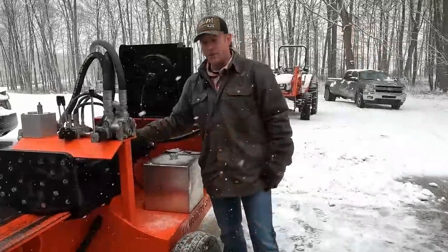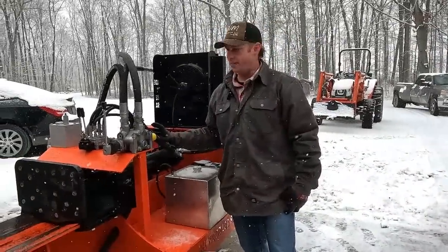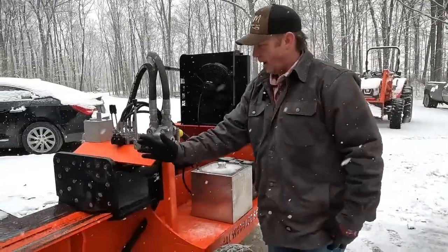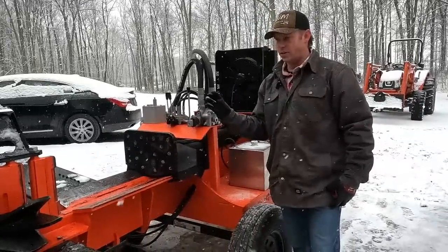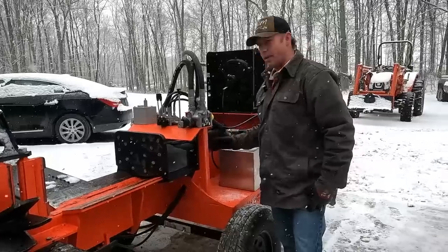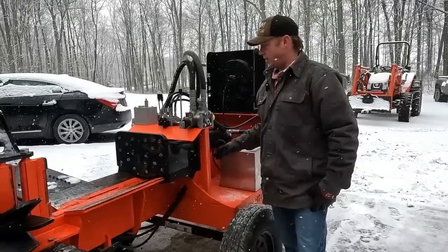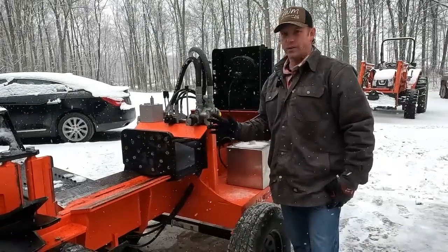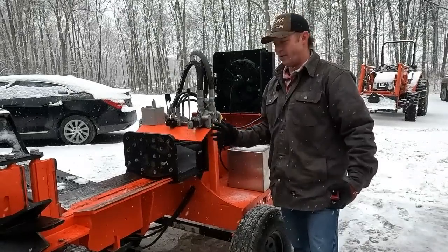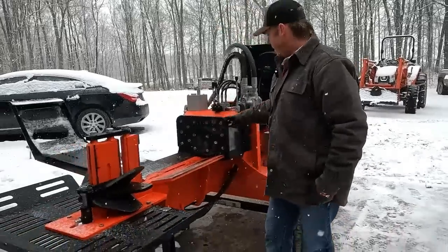On the Musclewood, I'm not sure on all of Bobby's versions, but the Musclewood, the cylinder has a built-in dampening system. So when this ram comes back, because it comes back rather quickly, at the last like inch, it dampens it so it doesn't slam into the end of that cylinder, which Bobby says prolongs the life of these cylinders, because it retracts so fast, so it lands soft. It's actually pretty crazy how it works. I have no idea how it works, but let me extend this out real quick